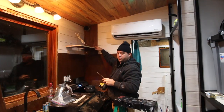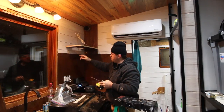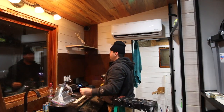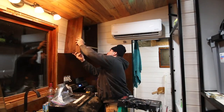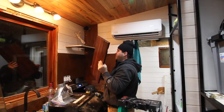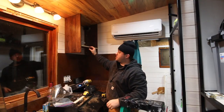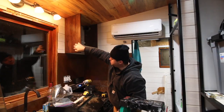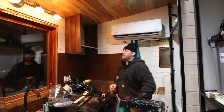So obviously I figured all my lengths and stuff so that the vent fits in here. And I've already done this, so when I uninstalled it, I put marks here, so I knew where to put this piece back in. Making sense and dollars. Good. Did you really screw up like that? You did. You put the pocket hole right where the thing's at. When I put the pocket screws into this piece, I made sure to put them so that the pocket screw comes right into the center of these three pieces. And I did glue all this together to give it some more strength and rigidity.